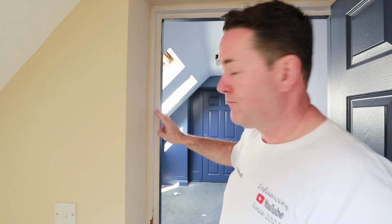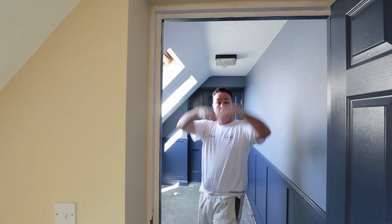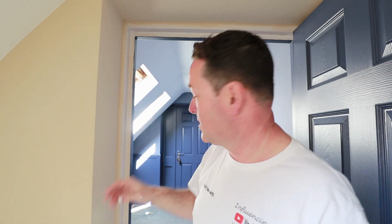Right, let me tell you, if you were painting in this section of the room and not this section, you'd be painting across the top on that left hand side, which is, again, your latch part of the frame. Keeping that face edge clean there, because just have a damp cloth with you, because it's going to creep round. Just wipe it off with a damp cloth. Tips of the trade. Because we've got a contrast, real contrast. They've got blue in there, and we're going to have white in here.